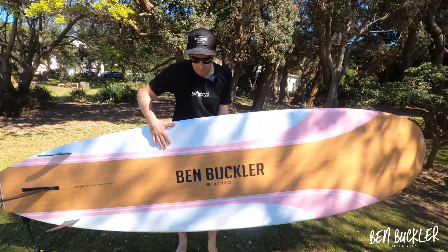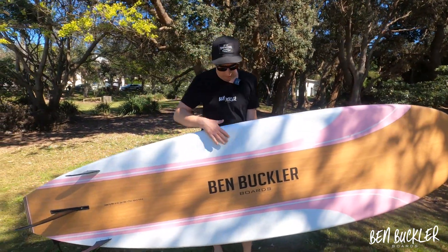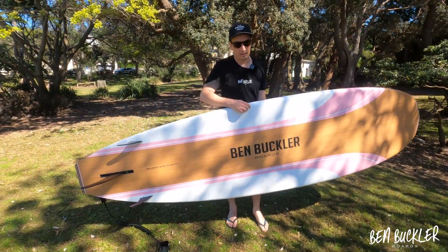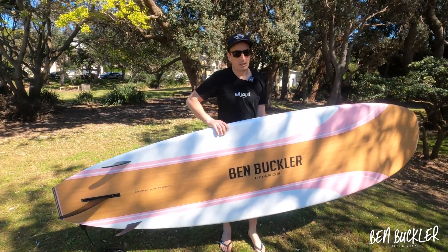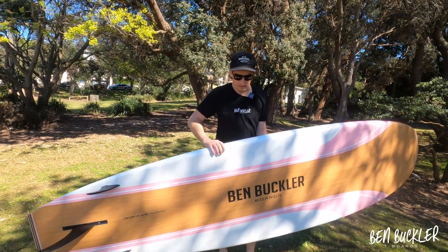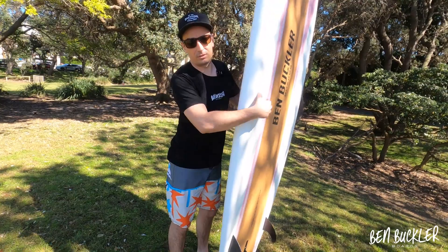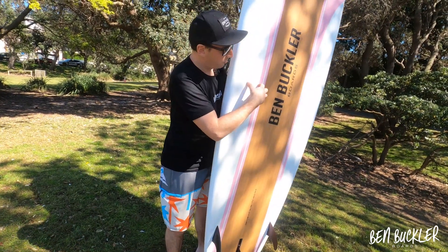So how do we make it light? What we do is have just two layers of fiberglass underneath — one thin layer and one thicker layer. That is less than most paddle boards, because we know that you're not going to stand on the bottom.